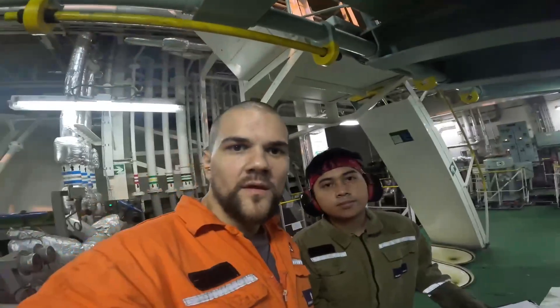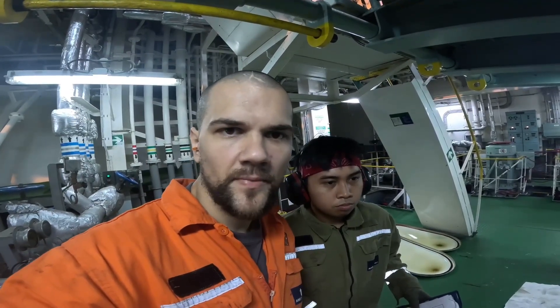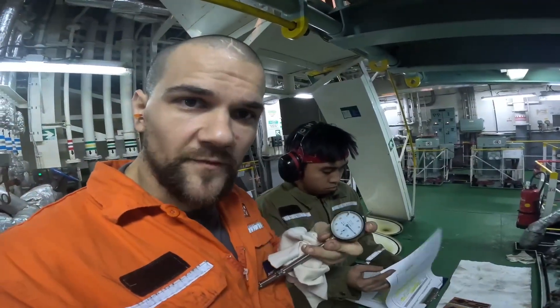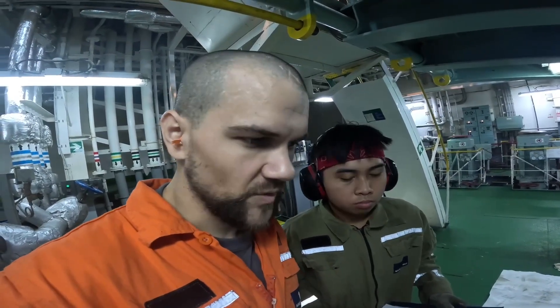Here is the schedule. As you can see in the video from the beginning, we opened a crankcase for ventilation a few hours ago. We ventilated this area for a few hours. Now we are going to perform crankshaft deflection using a crank web deflection gauge. Let me tell you from inside — it's still noisy here, diesel power back running. It's a much better view from inside.